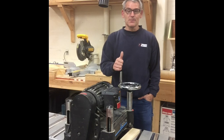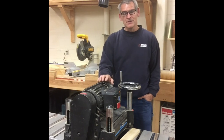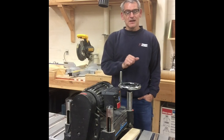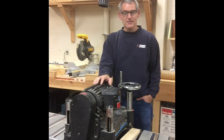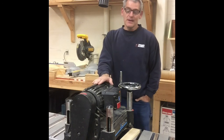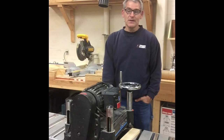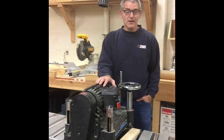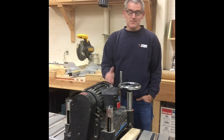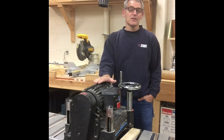Obviously, we don't want nails or other pieces of metal — they chip our blades, and chipped blades start leaving streaks in our planing job, which we really don't want. Those blades are $150 to $200 to replace. Even getting them honed and sharpened is $50 plus time, so we really want to try not to dull or damage them.